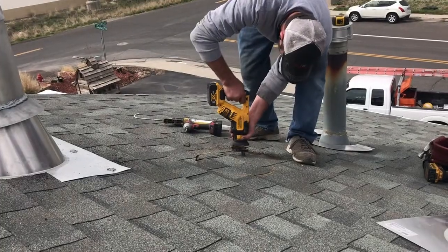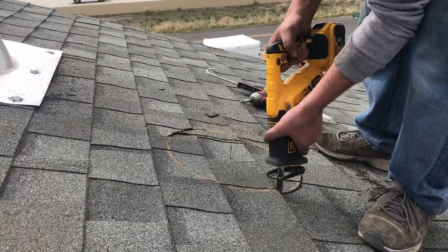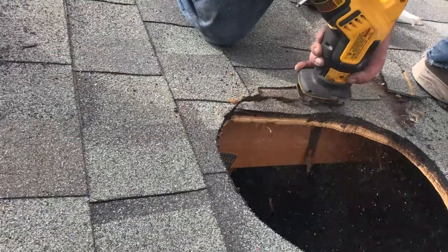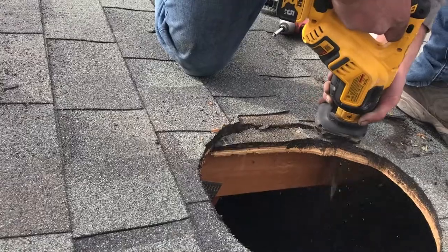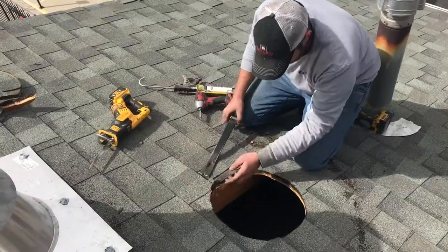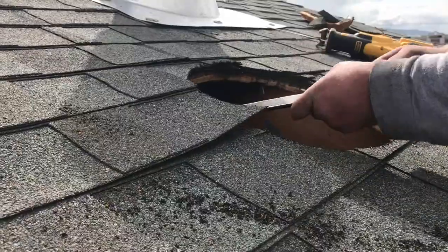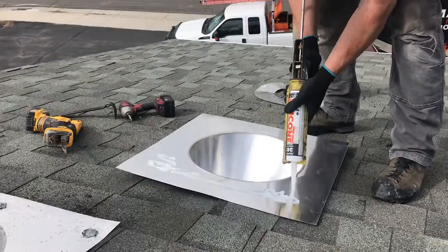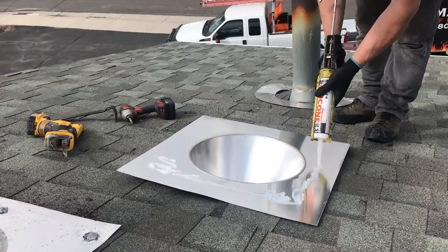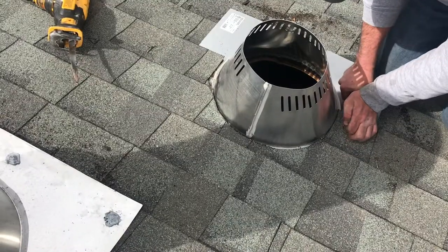Same thing — laser it up through to the roof, put our screw in there, and we mark that inside of the flashing. You can see that truss right there — we can't cut the truss, but we still have the two inches of clearance to our chimney pipe. We're getting all the nails out underneath the roof to be able to slide the flashing underneath. We've got some silicone underneath the flashing and we'll just slide it on under, just trimming a little of the roof.